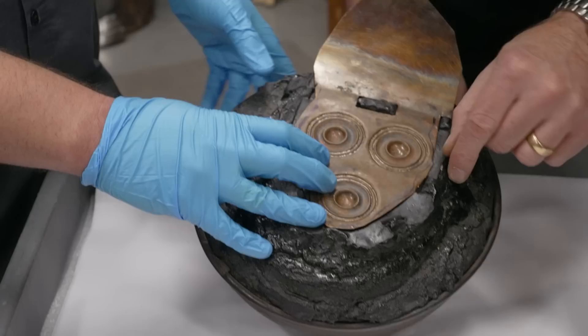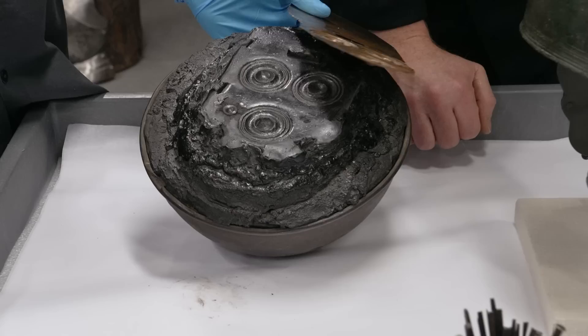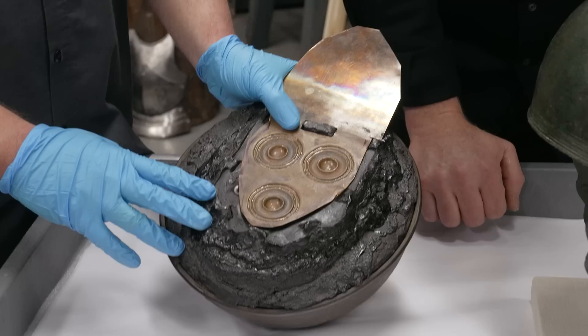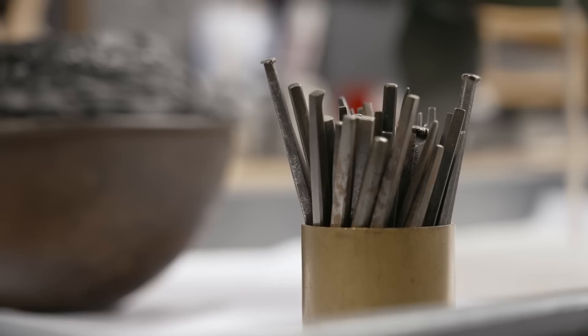Because this is a resin, it looks solid but it moves a little bit — you can actually see a loose hammer blow set in there. You can control how resistant it is based on temperature: the warmer it is, the easier it will take a blow, and the cooler it is, the more it will resist. So what we did here is cut out a sheet of bronze and hammered out these concentric rings, sort of folded that over using our vast collection of chasing tools.